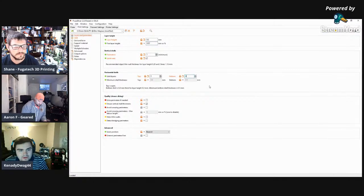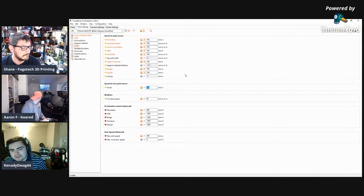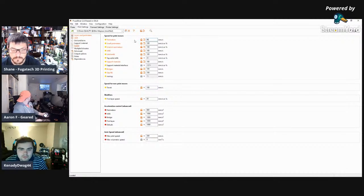Okay. And then go to your speeds. Set everything to 100, except for travel and first layer. Oh, wow, okay. Oh wait, you're running the 0.5 nozzle on this, right? Yes, sir. Okay, so I bump it down to like 90, just so that we don't accidentally over push anything. I mean, it's a 0.5 of the standard V6. It's non-volcano. And then for your accelerations, set everything to 7,000.